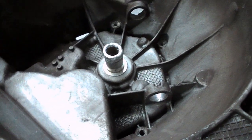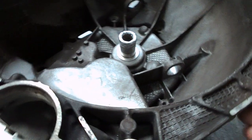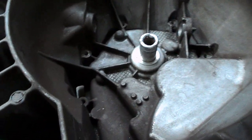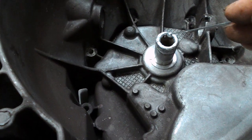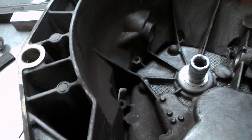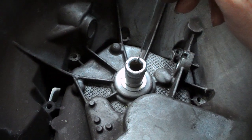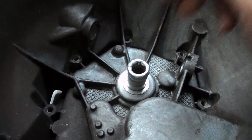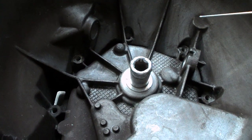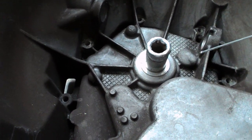Well, that's the top of this tube built up a bit, and we've kind of blobbed into the inside — just got some blobs going inside the bore of this tube here which we'll have to clean out, because obviously there's a shaft running through this. I don't think it's at all fussy, it just needs to be clearance, so that can probably come out with a file perhaps. The interesting thing is going to be how do we get this down to size — I'm just going to have to go on a mill, otherwise this is just not going to work.